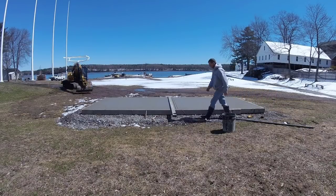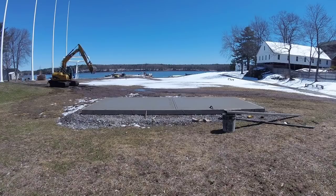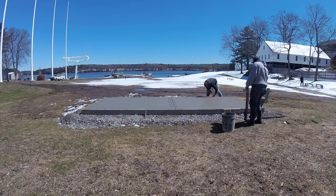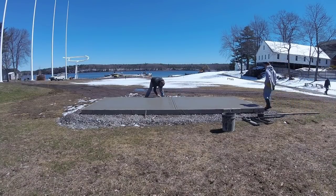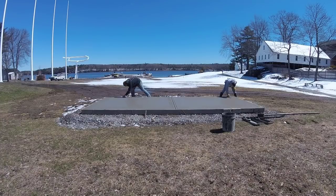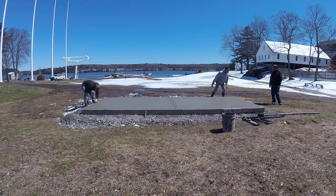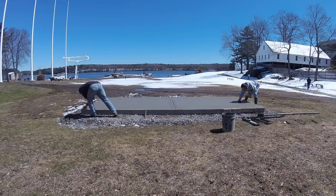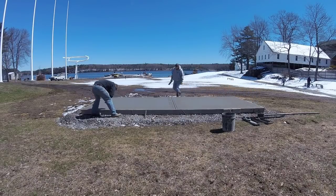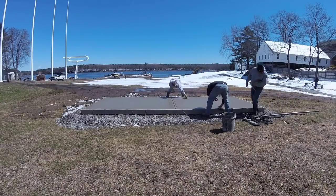We'll start cutting the edges in. You can see my guy over there has a two-inch-wide by four-inch-long brass edger and he's just running that along the board, rounding that edge off and giving it a picture-frame kind of look. We cut them in early and get that edge rounded off before the concrete gets too hard. I like to mag right after he cuts them in — I mag out any lines he leaves, obviously keeping the rounded part, but getting it nice and flat so that edge doesn't tip down.